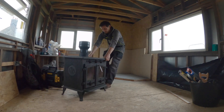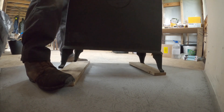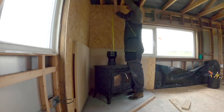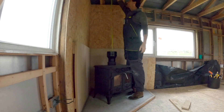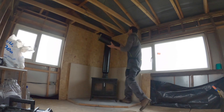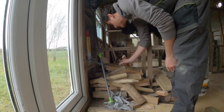Once the concrete was in, it was time to place the burner exactly where it was going to go. The burner itself was refurbished but we bought the twin wall flue brand new — that cost about £150 all in for all the flue pieces we needed. This was very much trial and error. We needed to get the flue in between the rafters without it getting too close to them, so I just dangled something down from the roof to find the right spot to cut through.